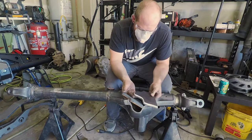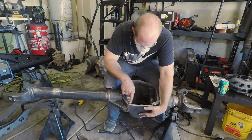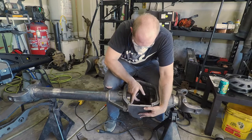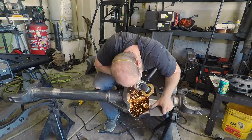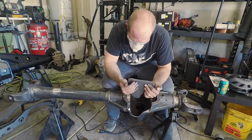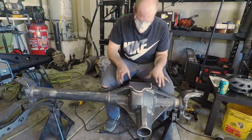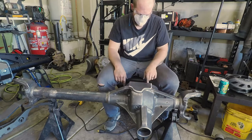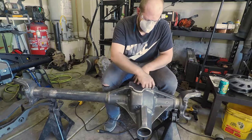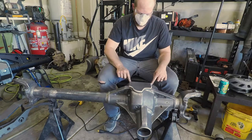Here's my modified bottom plate - pretty good one-for-one for a guy with a grinder. I want to weld right across this little face, so I'm going to bevel as much as I have to and leave the rest sharp - just a little surface to weld into. Another mistake I made last time - I just bolted the cover on, bolted this to the cover, tacked it in a few spots, and it warped. So I have a gap between the cover in one spot. This time, I'm going to put the cover on and while it's still hard bolted, I'm going to run almost all of the welding, then unbolt it and run this last little bit.